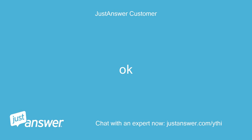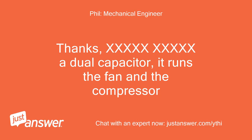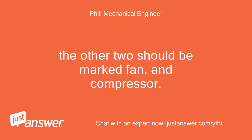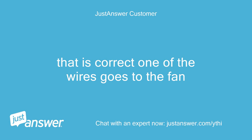Okay. It has three cups with red wire going to the compressor and blue wire to the run capacitor. Thanks. That is a dual capacitor, it runs the fan and the compressor. The center post is common. The other two should be marked fan and compressor. Some are not marked, but you can tell by where the wires go. That is correct. One of the wires goes to the fan.